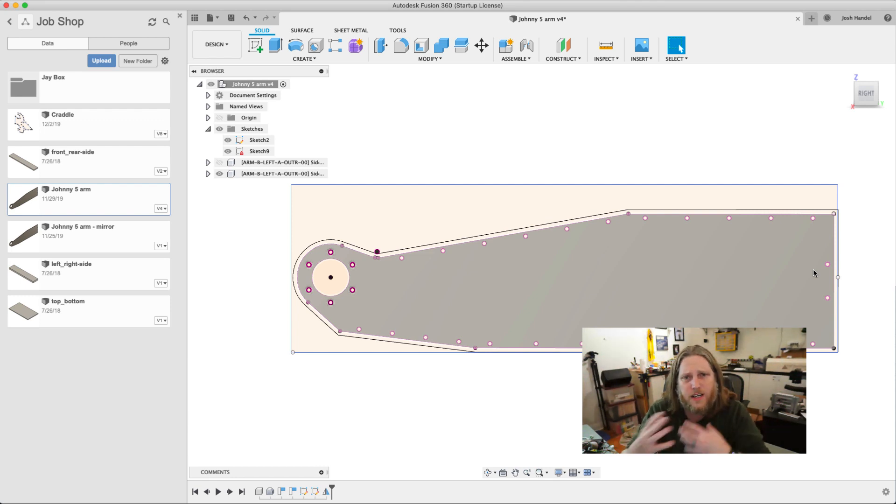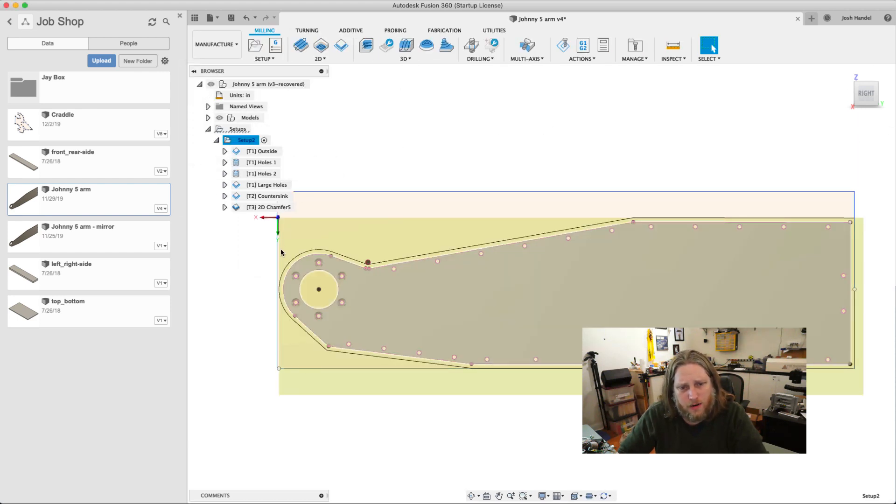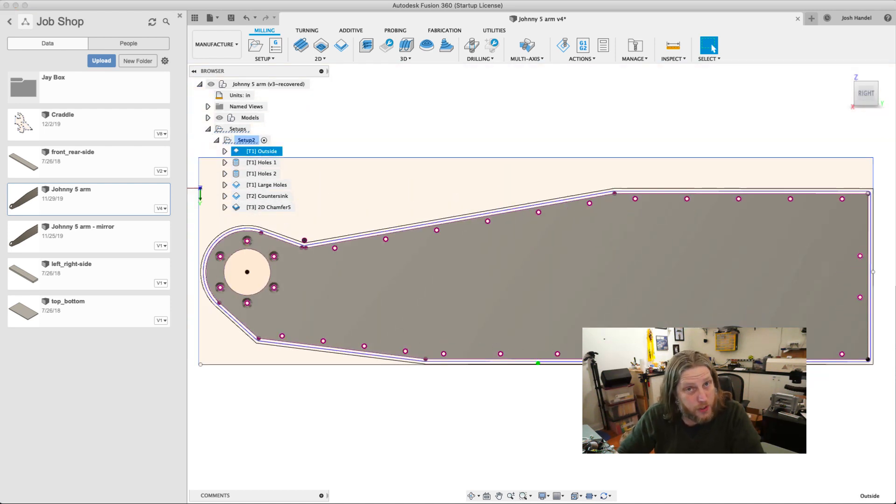The part had to be glued down. Let's show the manufacturing — pretty straightforward manufacturing here. Here's my stock. Basically my thought is I'm going to work right on this corner here. Outside, I used Proven Cut for the first time to do this. Proven Cut is John Saunders' startup where they test materials on a various set of machines with various tools and give you some starting points based on actual cut things. It's not math like G-Wizard, which I normally use — it's straight up like, 'Hey, we made this cut.' So, eighth-inch slotting with a Lakeshore Carbide variable-flute three-tooth end mill. They had exactly that and wanted to go 10,000 RPM.